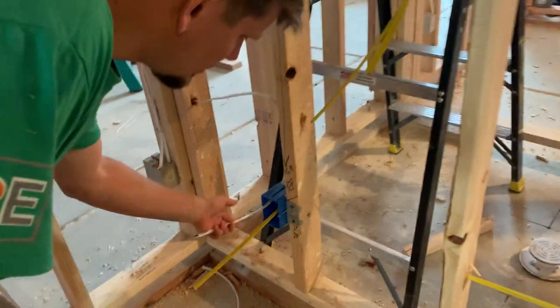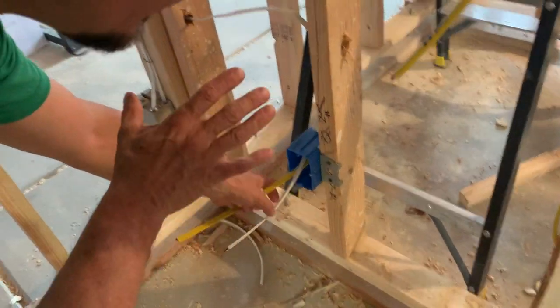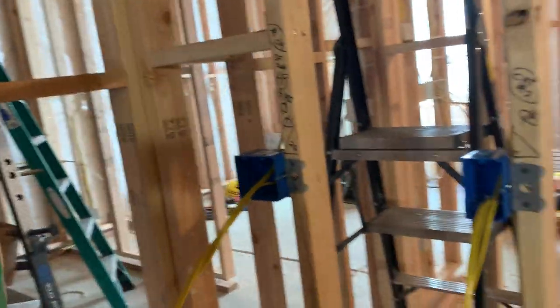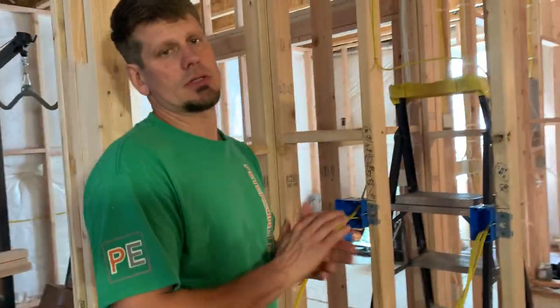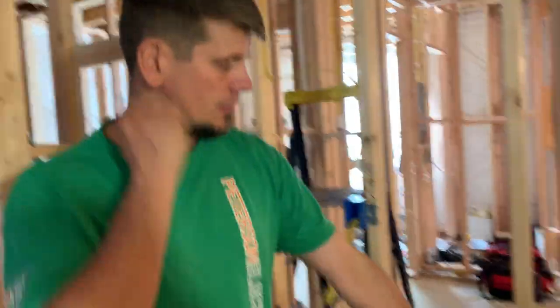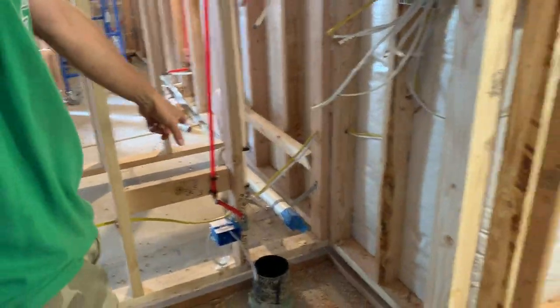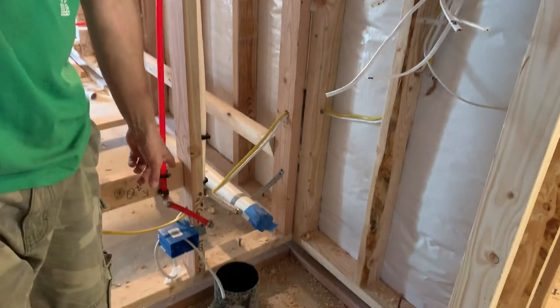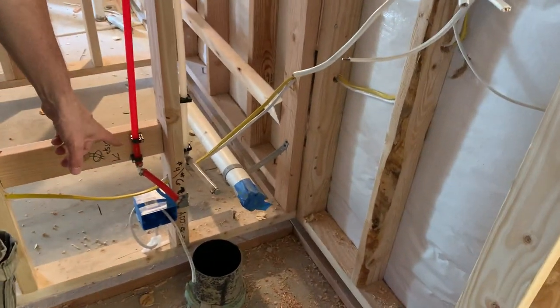Right down here they said they're going to do a little fridge, an ice maker up here, and maybe a microwave. You better have about three circuits in there for all that, especially because you have a garbage disposal. That switch loop goes up — if you switch-loop it down, remember: even if you do any switch loops, you have to have a neutral in all boxes now.